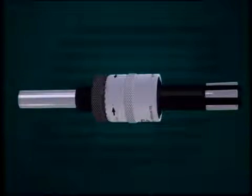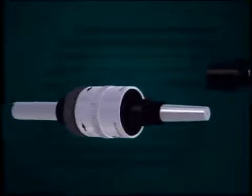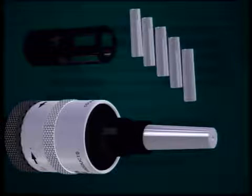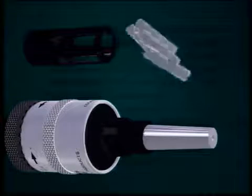The internal roller finish tool is representative of the entire roller finish family of standard tools. The parts of the tool are the tool body and shank, the mandrel, the cage, and the rolls. The tool shown here has five rolls, and the number and size of the rolls varies from tool to tool.